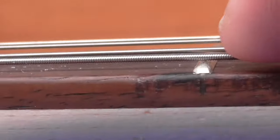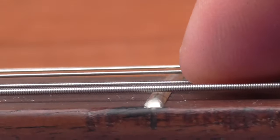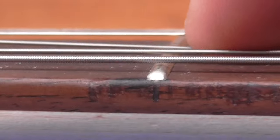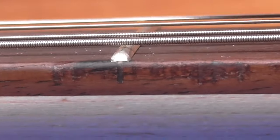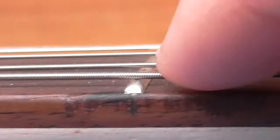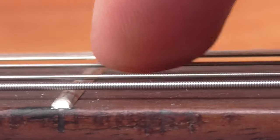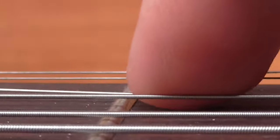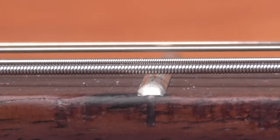So these two I've filed down to about half a millimeter. I've actually measured that with a set of feeler gauges. I've brought these down to half a millimeter, and this other one measures at 0.95 millimeters - that is ridiculous. You can see the difference.